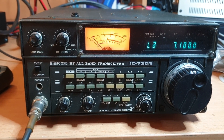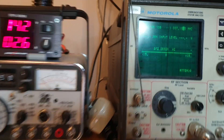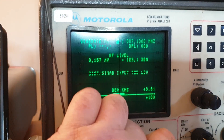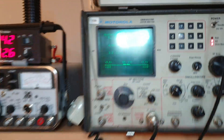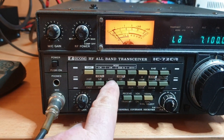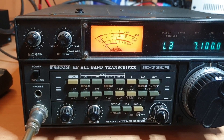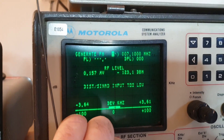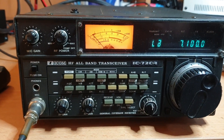Let's give you an idea of the receiver. I haven't tested this one, so I might come unstuck — you never know. Let's just put a little bit of signal in. What have we got there? 0.5 of a microvolt — I'm just chucking that in. I'll turn my monitor down; we're hearing more of the monitor than the radio. Okay, 0.5 of a microvolt — I'm hearing it. Attenuator works, obviously. And it's hearing it fine, but when I go down to 0.1 — minus 123 — I'm losing it. Probably not as super sharp as we'd like.